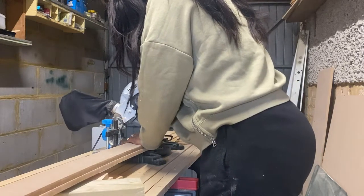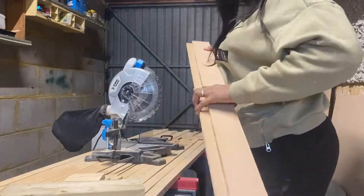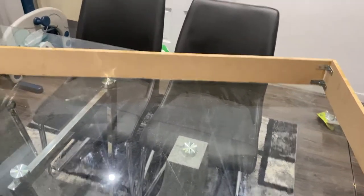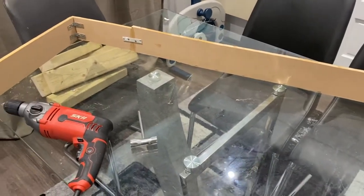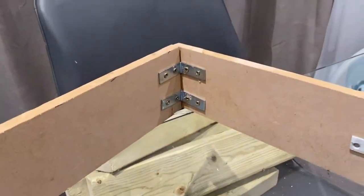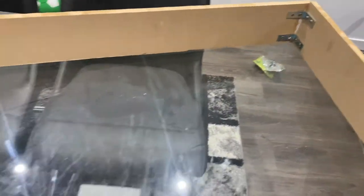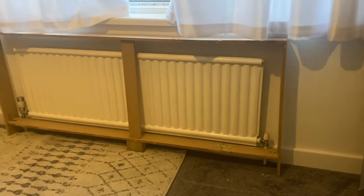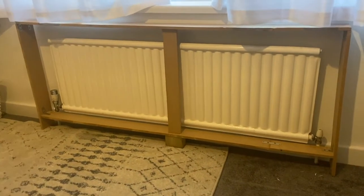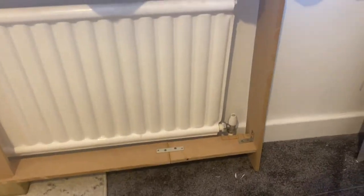Because I needed a saw, I got one and was able to make my cuts. Just make sure you allow one inch on either side so that the frame sits nicely on your radiator. This is how it looks once completed — excuse the mess; I had to move things to my living room to get a nice high table. I used some screws and angled brackets to secure the legs to the frame. As you can see, my radiator is not the prettiest, which is why I wanted something nice to cover it.